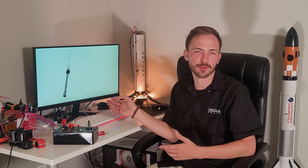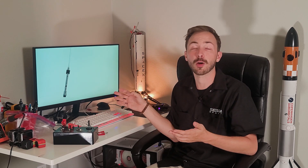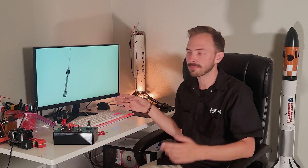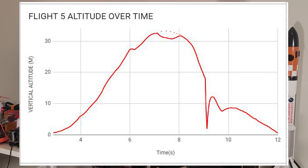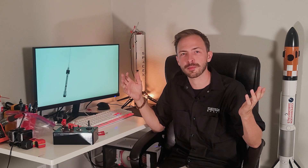For example, if that software had been in place on this flight, it would have most likely corrected back more towards the vertical. This rocket can't really do too much about the roll, but we're not really worried about that if we can figure out which way is up and maintain it. The flight made it to an altitude of about 34 meters, which is pretty good — pretty respectable given the offset it had — and it was able to maintain control in a pretty off-nominal state.